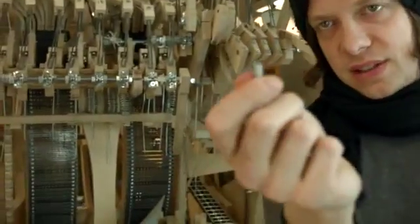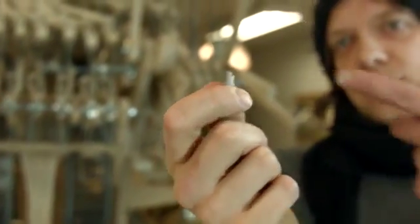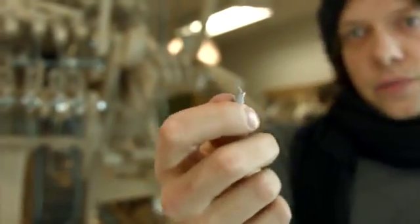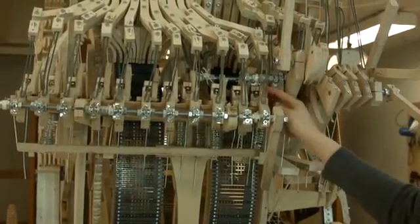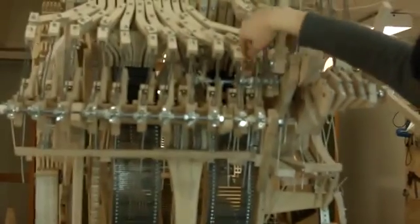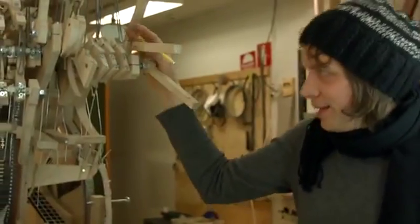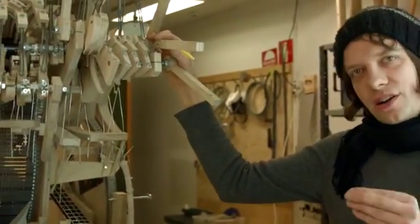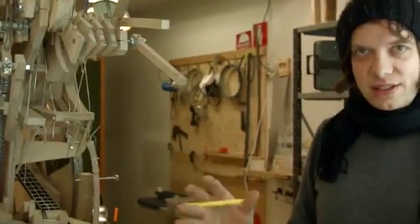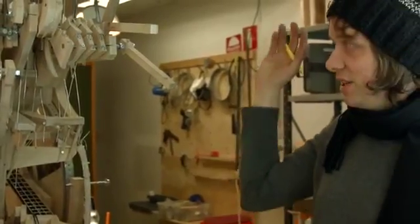Another problem is that we have wear on the programming pins, and when they get damaged, they stop registering the note and no note will come. And this, for example, is due to the fact that this marble gate here can't move up here. It smashes this bolt here like that, and it's just badly designed. When I'm playing the machine, when a song is fully programmed, all these design mistakes, even if they occur very randomly and very seldom, there are 30 or 40 things that could go wrong, it's still too many things that could go wrong, so it's malfunctioning a lot.